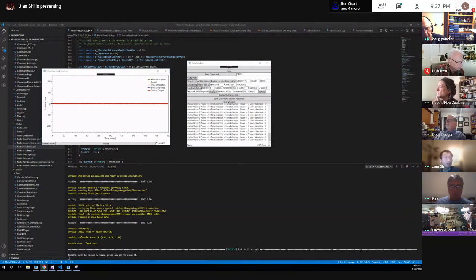are you actually driving a motor? Is this data from a real motor that you're trying to spin? It is a real motor, yeah. Okay. The reason I'm asking is that one of the things that might be impacting you is the PWM frequency that you're using. It has to do with the inductance of the motor's coils. Are you using Arduino or what are you using?